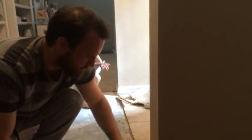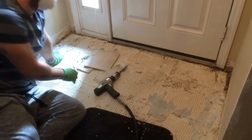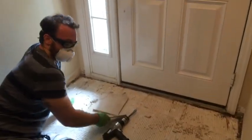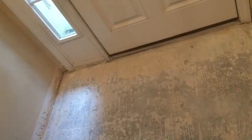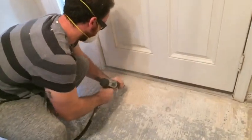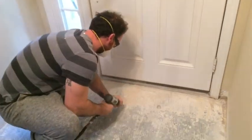We're going to start with basically clearing out the mess in the front of our home. Then we have to take up all the tile because we are doing flooring throughout the whole house. A little man is helping out here. We took up the tile using — I forget what that thing's called — but it was kind of like a mini jackhammer type thing that he hooked up to the air compressor. I had tried doing it with a putty knife or chisel and hammer and it was just taking way too long, so we decided to get this tool instead, and we wheeled the air compressor around from the garage and it came up in minutes.